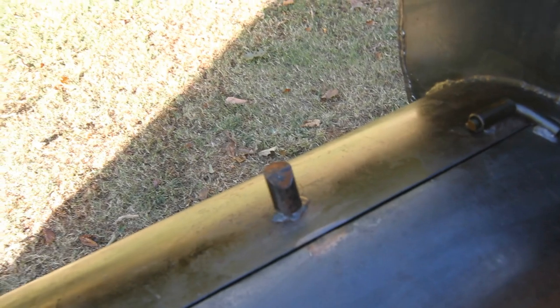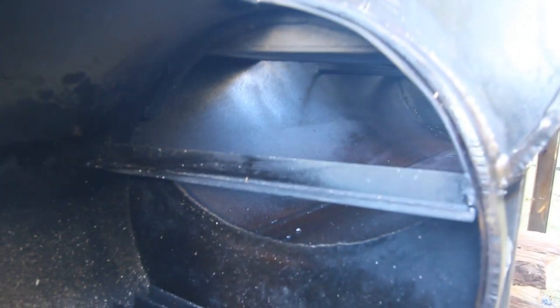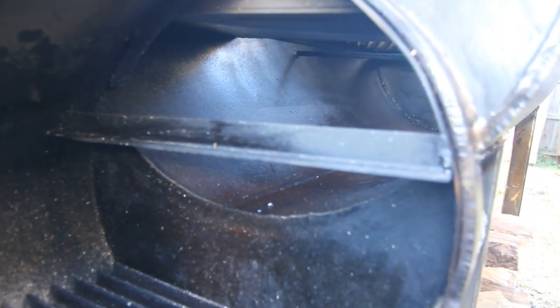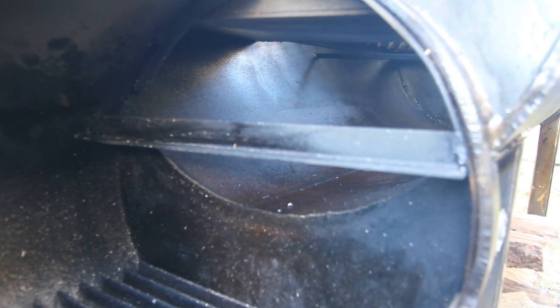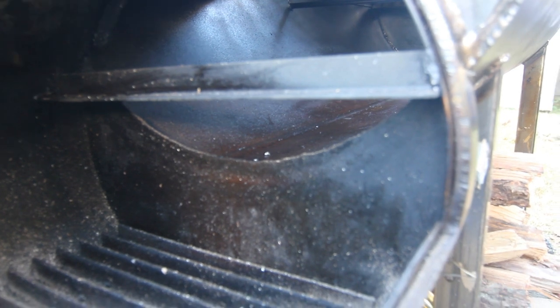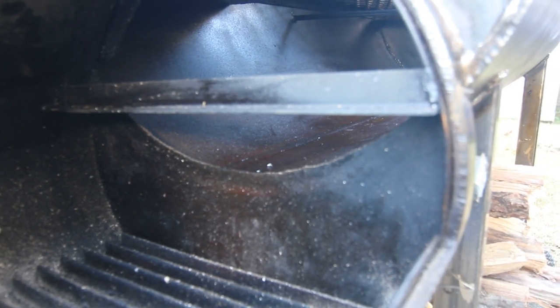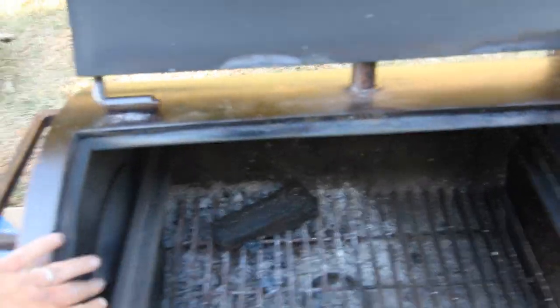We have these lid catches here. They are very functional, not the fancy horseshoes that they have for Workhorse Pits. Now the other really big difference on this end is the throat of the smoker. I sent a picture of what it should have looked like. Craig asked me to do it a different way, and I was kind of nervous at that point. I had asked for this 27-inch firebox, which I'm happy with — I like that extra few inches there.